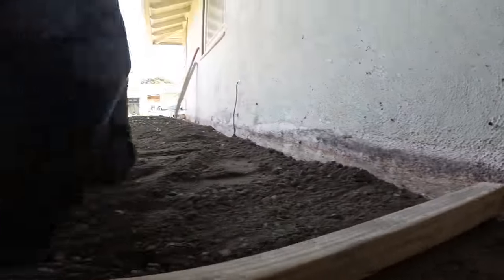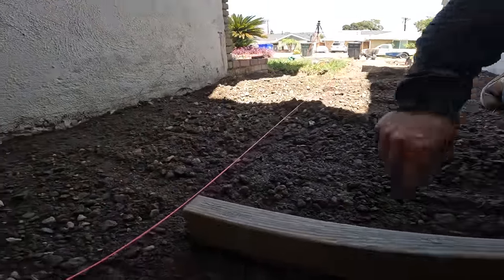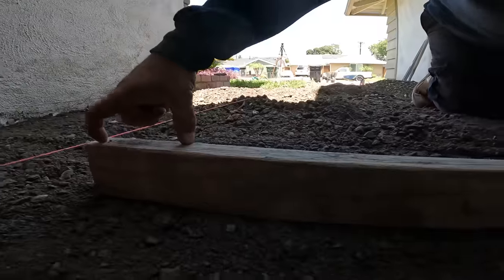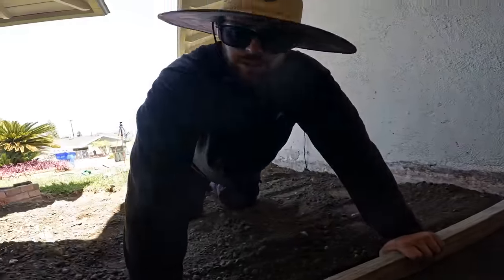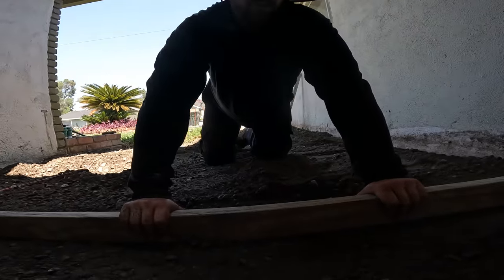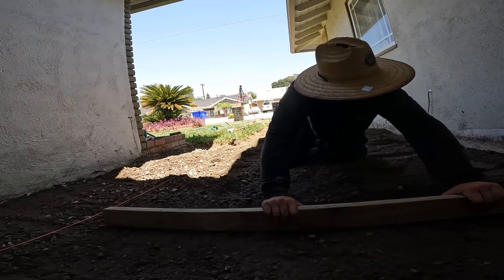And then look over here — that's my other grade line. That's going to be the height of pavers. So hopefully this gives you a little bit better visual. They're going to be putting a paver and sand in place of this two and three quarters. So all I'm doing — it's pretty simple guys. If you've seen all the other paver videos I do, this is what we do. We just keep it nice and flat and you'll get good at that once you do this a few times. Keep it nice and flat, and you want to be looking at both ways as you go down.